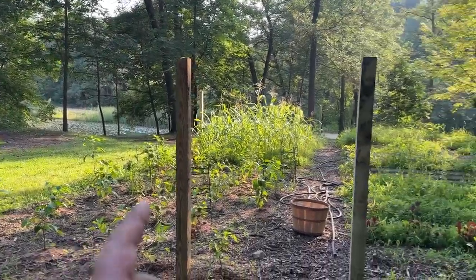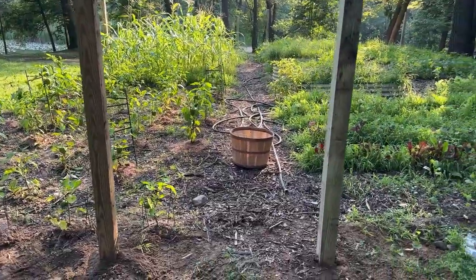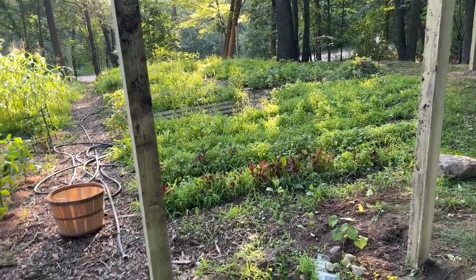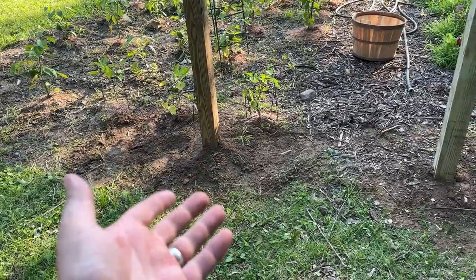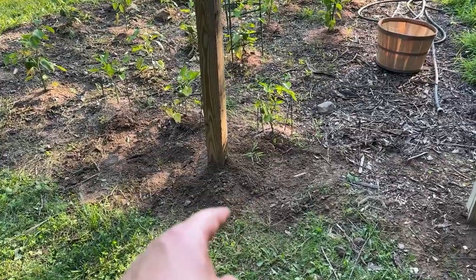We've got all our corner posts and gate posts in. We have a four-foot gate and a three-foot walking or wheelbarrow gate; the wider one will fit a golf cart. These posts will be connected with wood. Since this isn't a solid picket fence, there's less wind pressure. For a privacy fence with solid pickets and significant wind force, it wouldn't hurt to put some dry cement in the holes, mix it with the soil, and spray it down with water — you don't have to pre-mix it, though mixing properly does work best. Lots more work to do, but hopefully these tips on setting posts helped. Don't forget to hit thumbs up — thanks for watching!